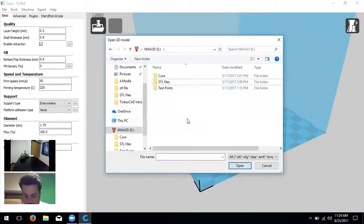Navigate to the SD card and click on STL files — remember, once we make a design and export it, we export it as an .STL. The original file format depends on which program you made it in. In Fusion 360, it would be a part file or .ipt or similar. They'll be part files making up whatever the assembly was — it's specific to the CAD program you use.